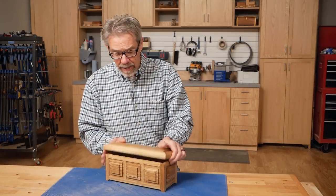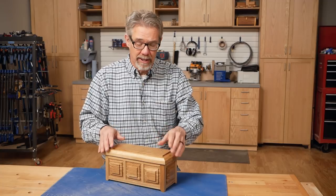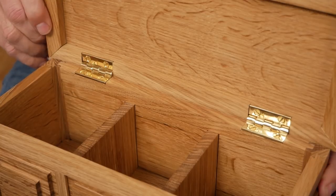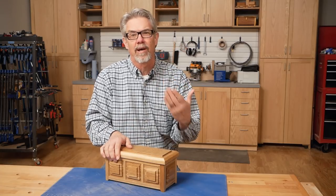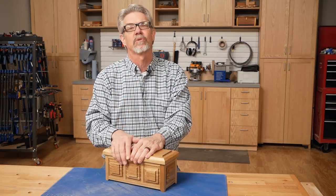After I took it out of the clamps, did the final sanding on it, and sprayed it with a spray lacquer — it looks great. Then we mortised for the solid brass hinges; I did that on the table saw too. There it is: a nice little box, completely made on the table saw. I'm Rob Johnstone from Woodworkers Journal. Keep on making sawdust, and thanks for watching.